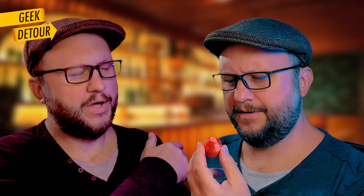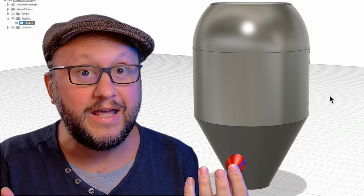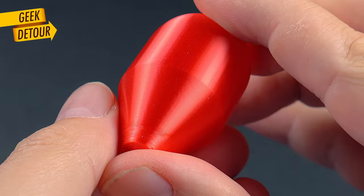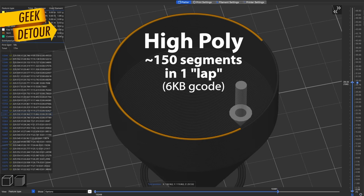If you are an experienced user, you will shout: your model has too many vertices. Vertices? It's round. But it's true — STL models are in fact made of triangles. Even a cylindrical shape gets transformed into polygons. You can make it very low poly so it doesn't look so rounded anymore, or you can crank it up high poly with enough triangles to make it look really smooth. Quality has a price. On a low poly version, this circle uses just 50–52 movements per layer — two kilobytes of G-code. But on a high quality model, the same circle is broken down into 150 movements, six kilobytes of G-code for the same layer.